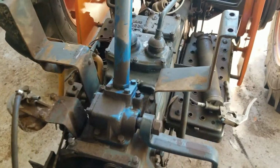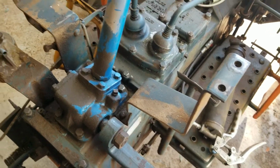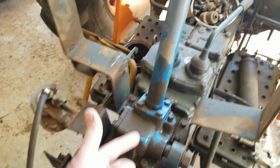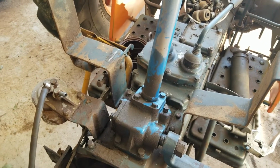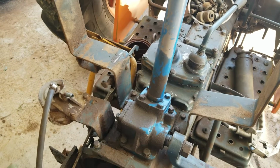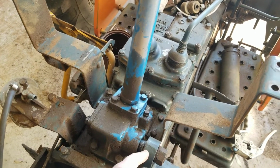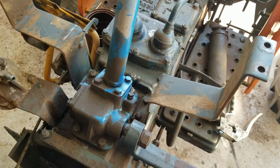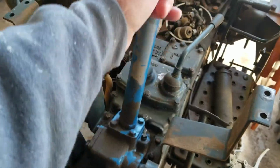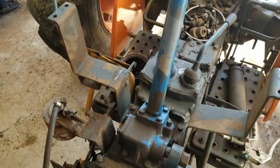Remember, on this tractor, or if you've stayed subscribed, I don't know if it's on this channel or my other channel, this steering column is from an L245 because they're more common than the L295. And what I did is I shimmed right here, put shims in there so that this would fit. And it's a little bit of a knuckle buster because it's just a hair shorter than the L295.